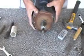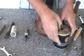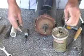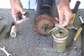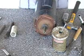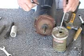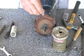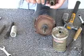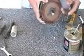We want to do a couple of things to it first. I like to make sure, again, I just have a little bit of grease. Just a little bit on the shaft is all we need. You don't need much. These set screws, if they're stainless steel, you don't need to worry about it. If they're not stainless steel, it's also nice because when these get wet, if they're the zinc type Allen screws, they will get seized up. And that's all this is for, to make sure that this shaft is going to stay free, which you'll see when we come to adjusting the impeller is something that's important.